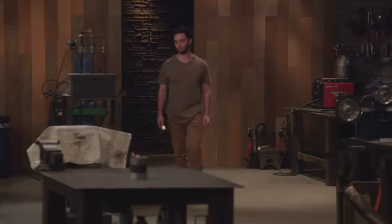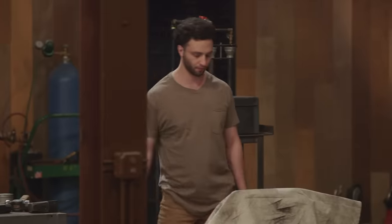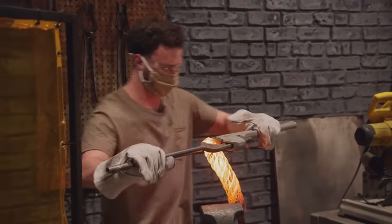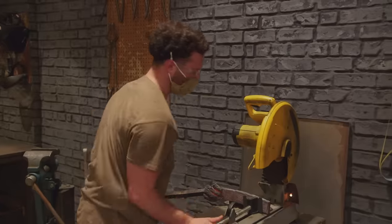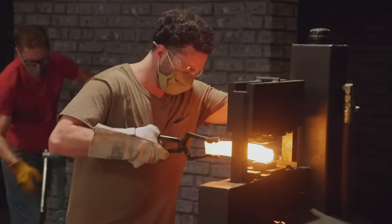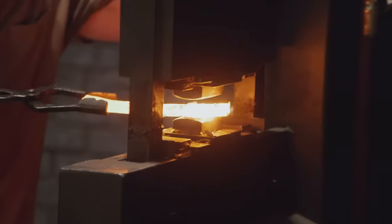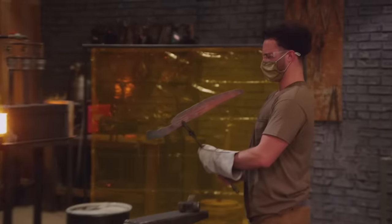My name is Paul DiStefano. I'm 26 years old, and I'm an EMT for the New York City Fire Department. For me, bladesmithing is purely an artistic outlet. I like blades as forms of art because it's brutal, but it can also be elegant — that's something you don't see often in other forms of art. I've made Cable Damascus before. I'm trying to keep it thick so that when I go over to the grinder, I can dig deep and carve out any bad welds along the edge. With Cable Damascus, the outside is always going to have bad welds, so I want to grind most of that away. I finally finished grinding and I think my welds look solid. Now I have to hurry up and forge out the blade because I lost time grinding. I didn't quite get to everything I wanted, but I'm happy with the knife I finished for this round.